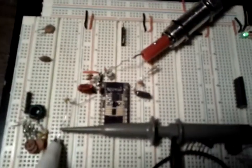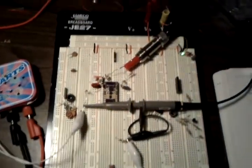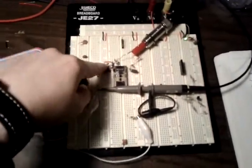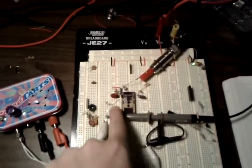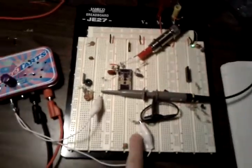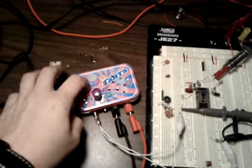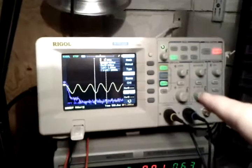I have that coming into a little SA612 circuit, coming through a tuned input, with a 10 MHz rock-bound crystal oscillator. The output is just a cap on pin 4 coming out over here. These go into a little LM386-based amplifier based on some schematics from qrp.pops.net, and that also goes off over to the oscilloscope.